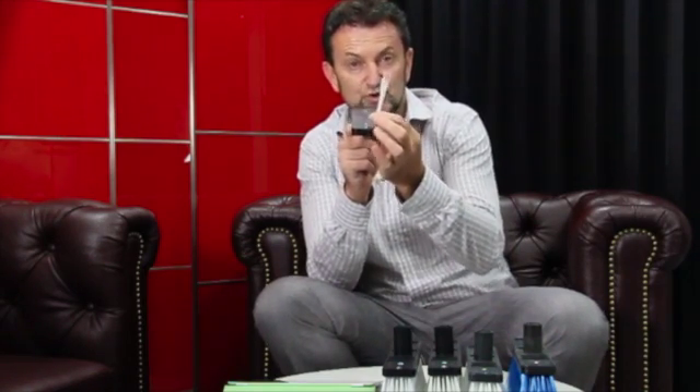In this video we're still talking about bristles, and this time we're going to talk about the number of bristles in a brush, because it's the tip of the bristle that gives you scrub power or agitation power. Going back to how a brush is made: every brush starts as a block, goes into a machine which drills a hole and puts into the pod a number of bristles, and staples or resins them into location. The question is how many bristle tips are in each pod, how many pods have been drilled into the brush, and how does that affect the behaviour of the brush as a waterfed pole brush.